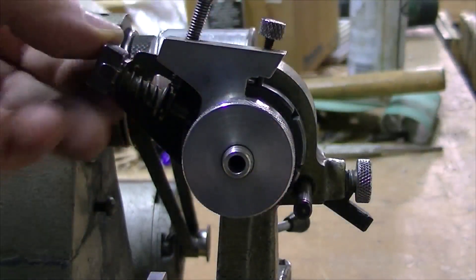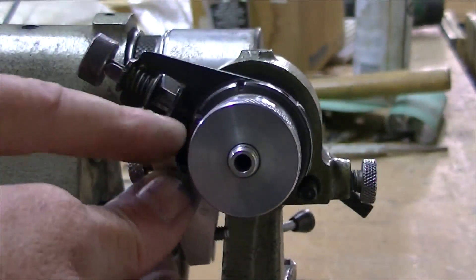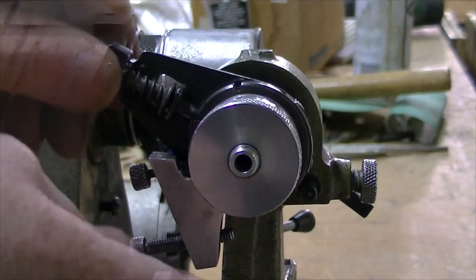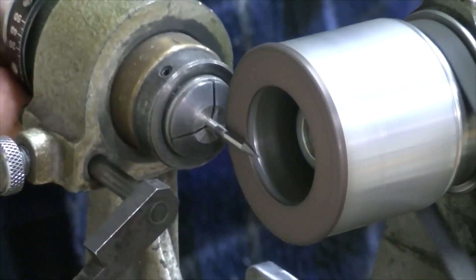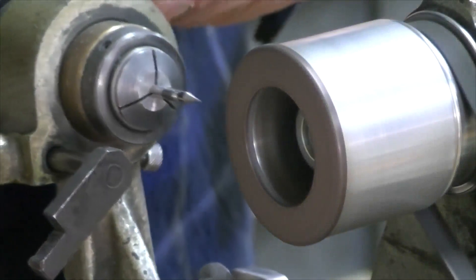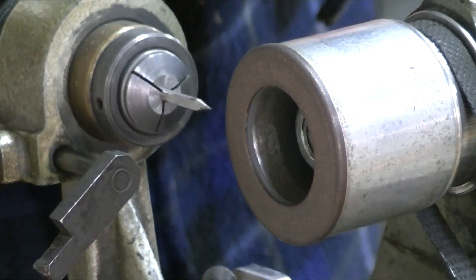Now this is where all the good things happen. We've got a lock here — you can see a notch just there, there are another couple of notches there. This notch here is where I'm going to start off, so I lock that in position. That will what's called split the tool — in other words, grind the flat on it. That's all I need to do. Start it up. Still a way to go, but you can just see it reflecting there.